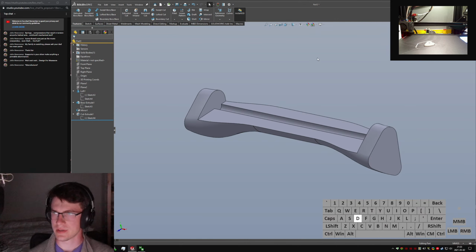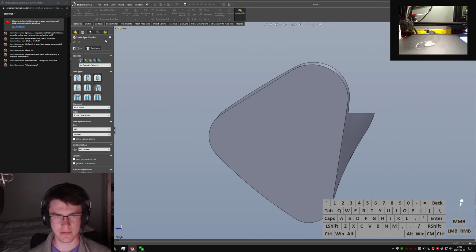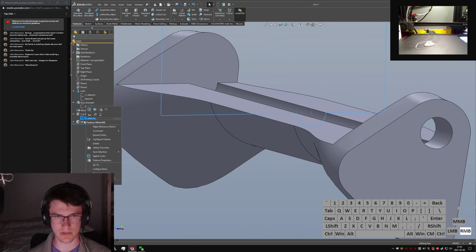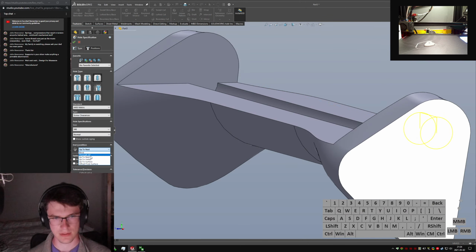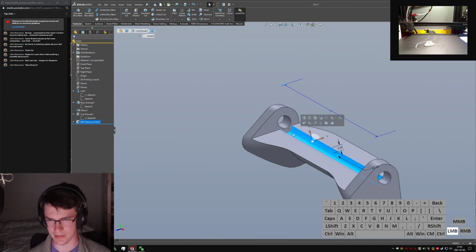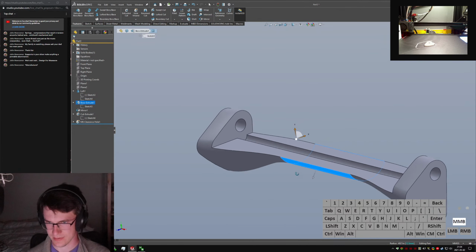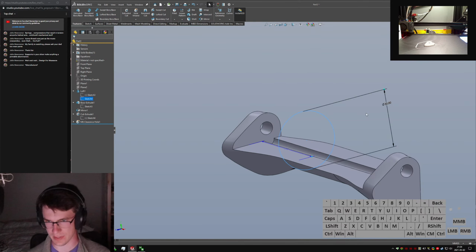But now I could do a hole wizard through just a random plane, say over here. Enable work positions. And that one is only up to next when I want it to go through all. So I have to go back to the property manager and change that. Through all. And then I could have my cutouts that I interface on either side. And this is looking kind of goofy because nothing's sized right. Even make this a little larger, more like 30.